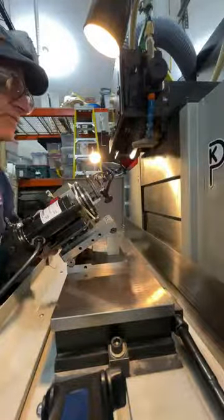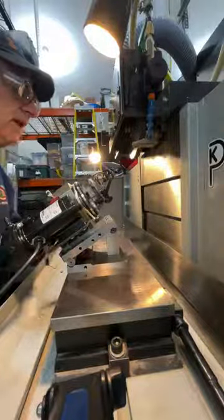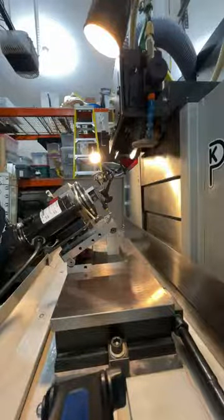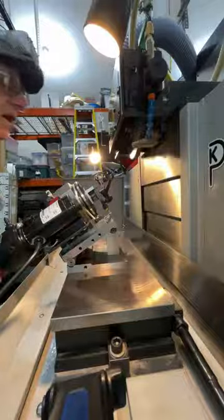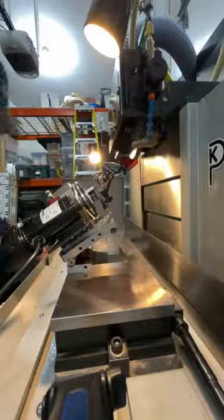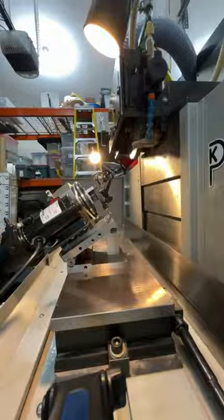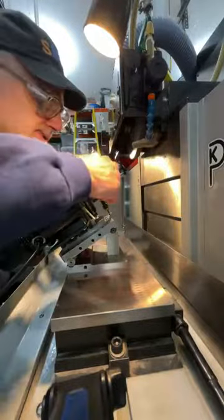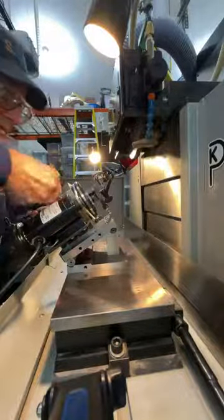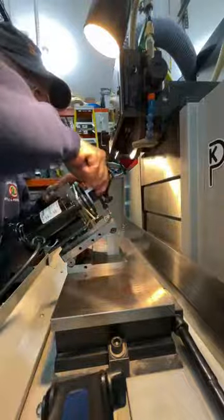Okay. So now going from the top to the bottom, I'm getting 13 thousandths, okay? I want to cut that down to a total of 5 thousandths. So I'm going to get my Allen wrench, and we're going to loosen things up. Oh, also, I'm going to drop the pin in here so that it doesn't go walking on me. So the pin is set to 180 degrees, and I've locked it.